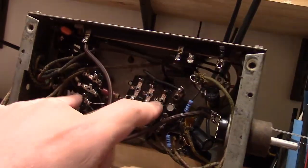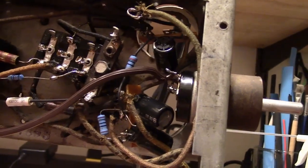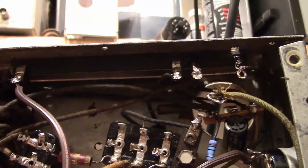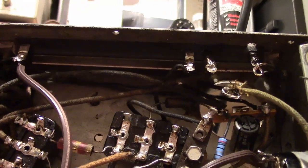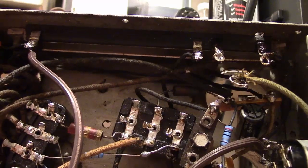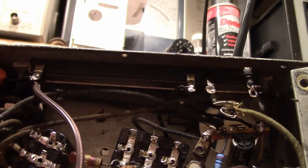The rest of it — I already re-stuffed the bakelite blocks last time. A few original resistors left in here — those will go. I'll double-check the wiring, which leaves the big power resistor. I experimented earlier with replacing that with a diode or capacitor rectifier. It does generate a bit of heat, but for now I'm just going to leave it in there. It still functions fine — it kicks out quite a bit of heat, but I probably won't be playing this a whole lot and it works.